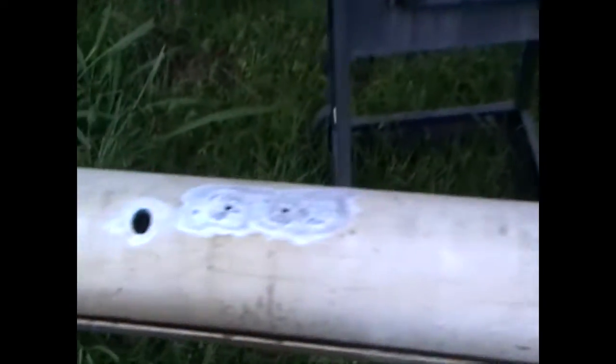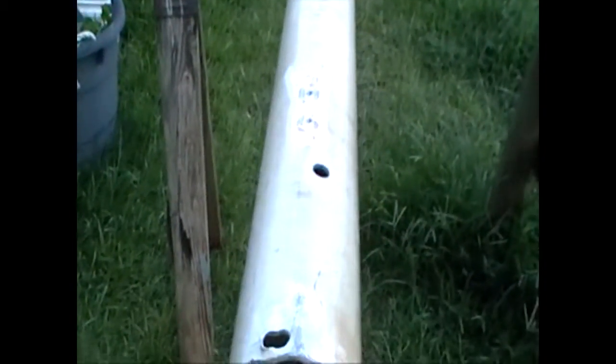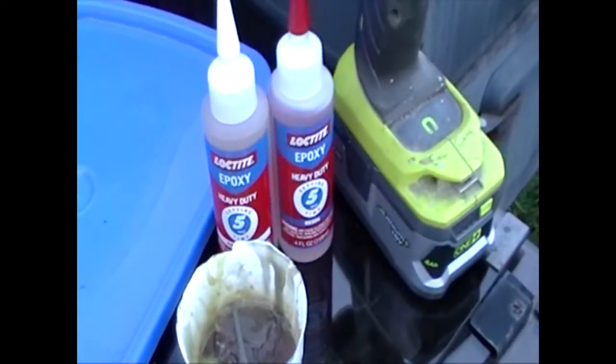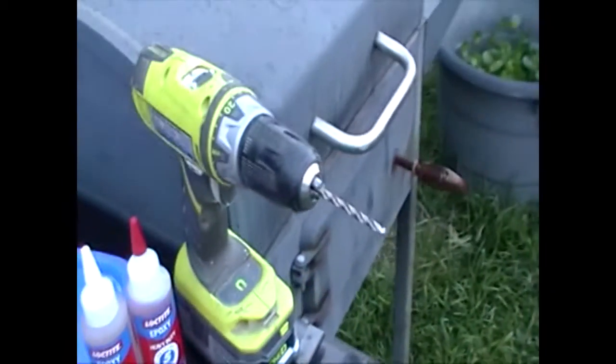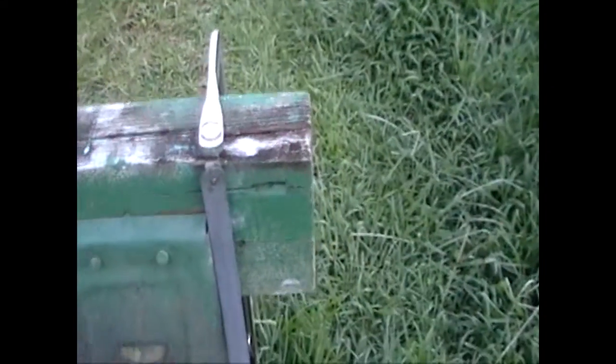I also found out, because of the thickness of my mast — I'll back over here and show you how thick it is — it takes three turns for this 28-threads-per-inch to go through. So my intention is to take the threaded portion at the bottom and dip it in two-part epoxy. I'm using Loctite. This is my mixing pot; I use a nail to do my mixing and dabbing, my drill, my wire brush, and over here is my tap and my hacksaw.